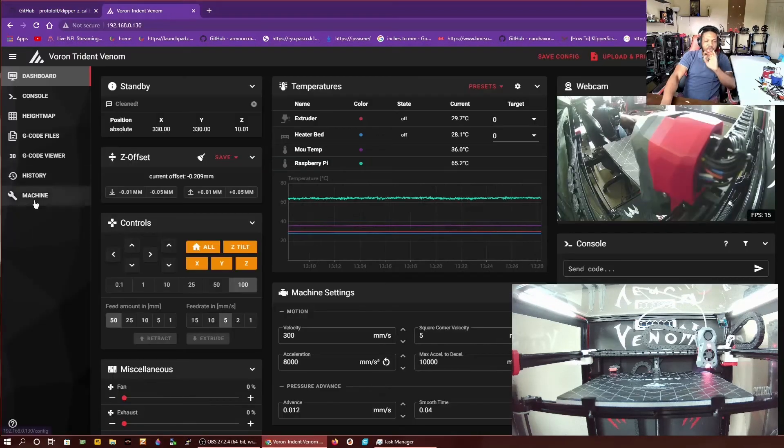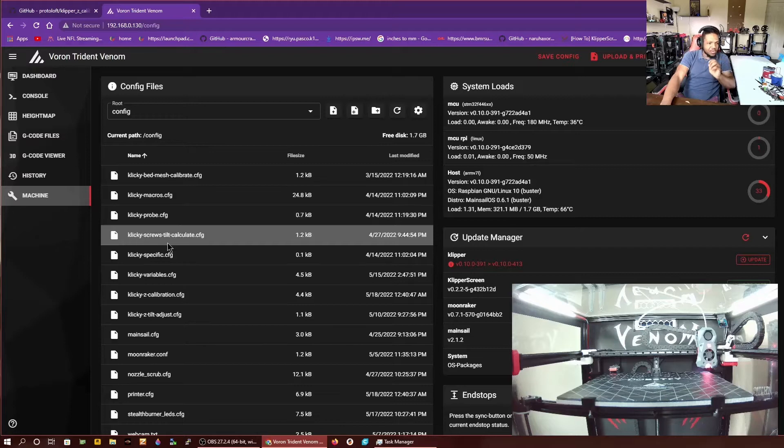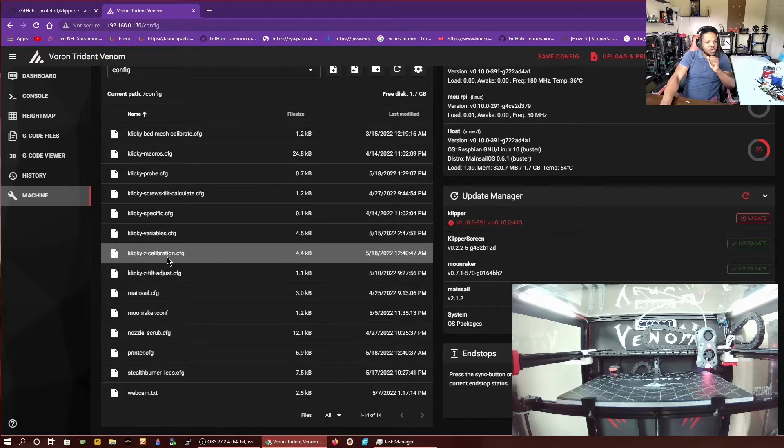Now when you come here from the last video, you're going to go to your machine. I'm using Mainsail in this case — it's similar with Fluidd. As long as you can access the config file area, you should be okay. If you go to where it says Klicky Pro here, before I had this commented out with a hashtag because I didn't have the appropriate script and files in order for it to make use of this. You have to hashtag it out, else you're going to get an error. But now that we dropped that file in, we can go ahead and remove the hashtag.